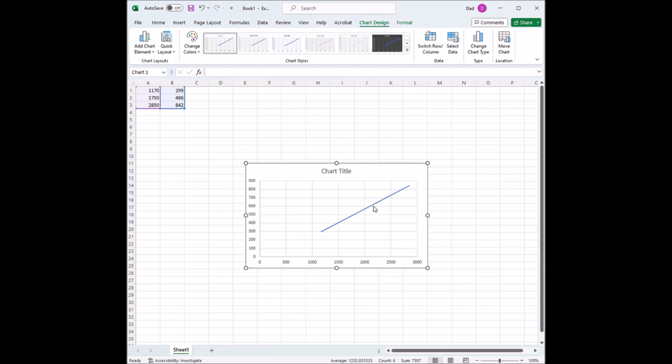happen. They could have fixed this easily had they immediately taken the filter out, washed out the filter side. The other side's the cyclone side, which is a clever design. And if they'd flushed everything out, and then probably even right then, they could have maybe flushed out the blower, taken the hose off the blower and run some water down through it, and maybe just rocked the belt back and forth to free it up.